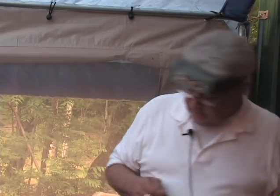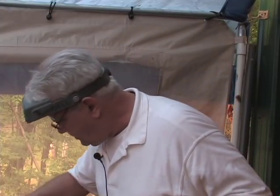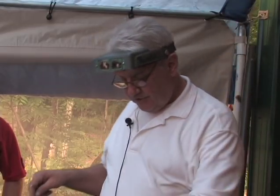So then you take your sheet gold and put it on a block like this. Then you take your tape that has the image right on it and put it over the top of it. Then you use a rounded nose cutter like this, and you can cut the whole design out at one time. If you notice the over and under shotgun, there's a Greek helmet in there. Well, that helmet and all the rest, that whole area was cut out at one time and then placed there, and then another piece of tape put over it, and then knocked in place.